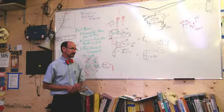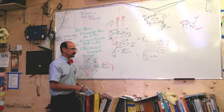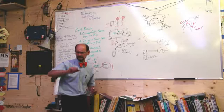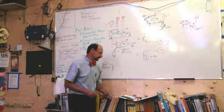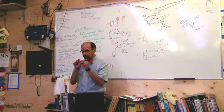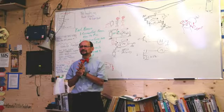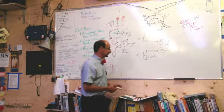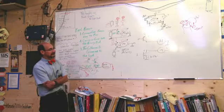One thing my son once said was: you can computer-design and simulate circuits all you want, but when you try to get them to run, generally what you need is to take a handful of 0.1 microfarad capacitors and just sprinkle them over the whole thing — like seasoning. If you look at well-designed circuitry, every chip has its own 0.1 microfarad. Isn't that a bit like voodoo — waving the dead chicken over it? These are so much cheaper than dead chickens, and easier to solder to.